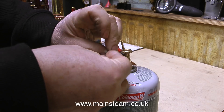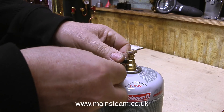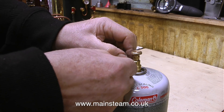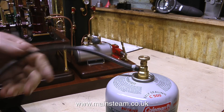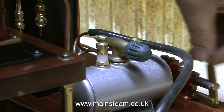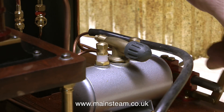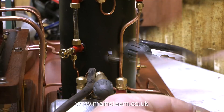What I'm doing at the moment is fitting a tie wrap around this pipe to make sure that the gas doesn't leak from this temporary connection. This small Cotswold Heritage boiler plant has its own gas tank but I don't have the adapters to fill it and it's easier this way. I remove the gas pipe from the small tank on the baseboard and just push the silicone rubber tubing over the pipe union on the end of the pipe and this will seal it fine.